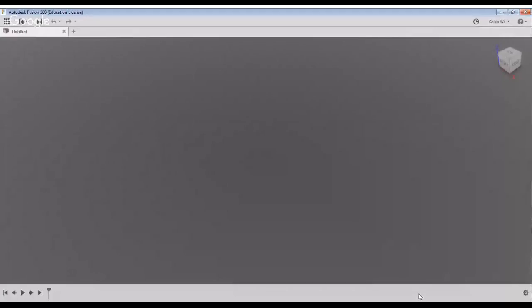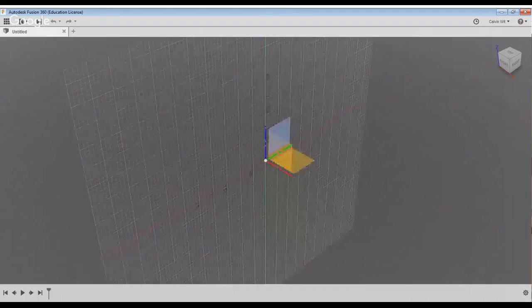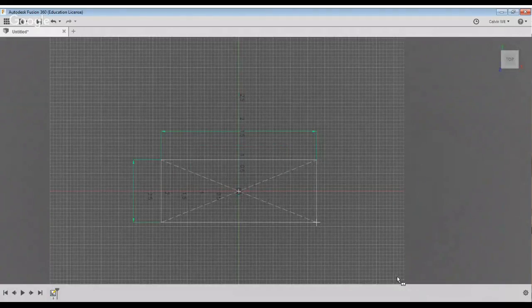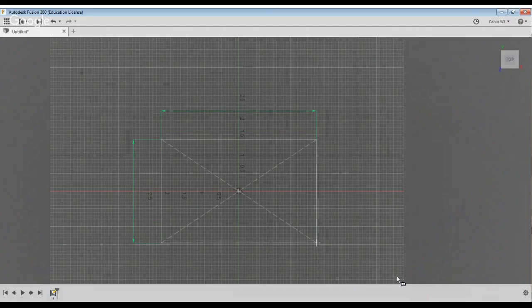Okay, so let's fire up the wonderfully buggy screen share. Now let me pick the application window in Fusion. Share that. Let's see if it's working. Give it the requisite 10 or 15 seconds that it takes. Come on. Yay, it's working. Oh, perfect. Okay, so let's see. I'm going to use a center rectangle, that's my go-to. I'm just going to use this plane. Now, this is the beauty of designing in Fusion, things like the center rectangle. So I'm going to do 2.925 inches. Whoops, that was supposed to be 0.65. I am not awake today.